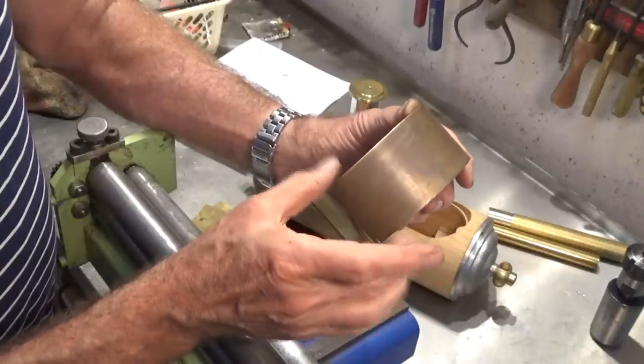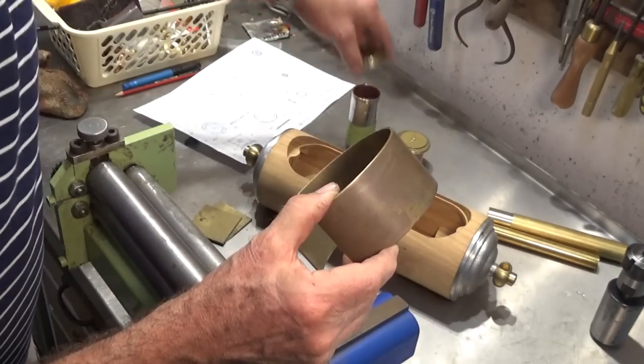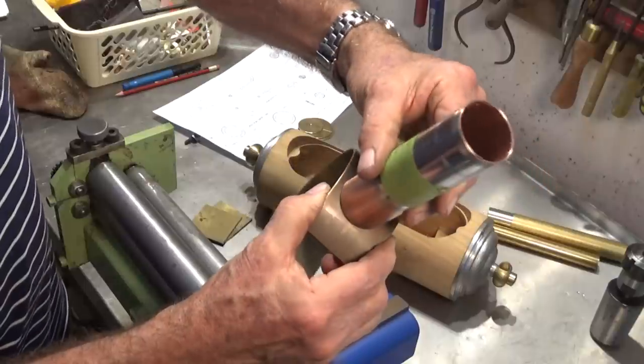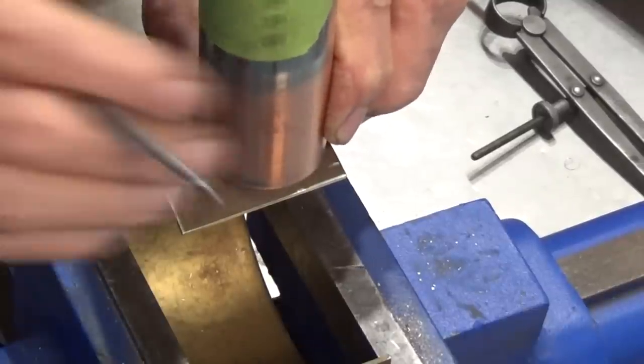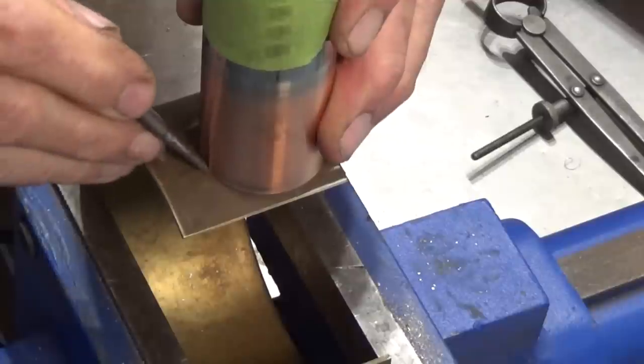And then we've got to set this up in the lathe and actually bore it out to fit over our piece of tube. So it's going to be mounted basically like that, and then we can finish turn the outer edge of the flange. So if I put my copper tube there and push it right up to the back edge and mark that off there,